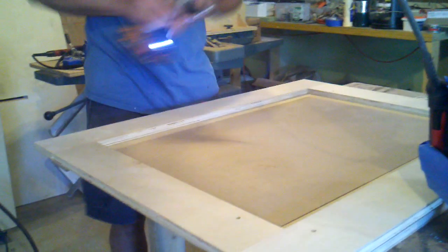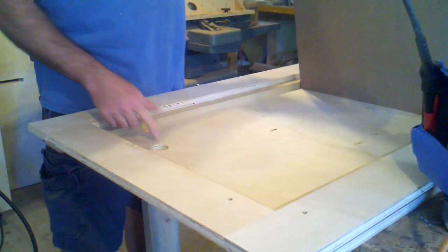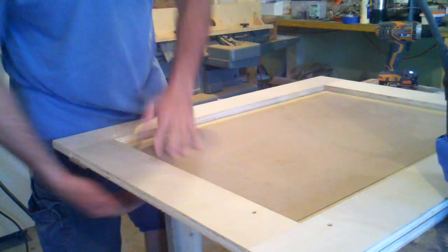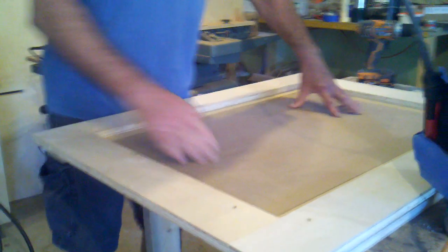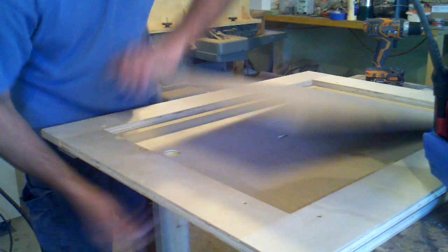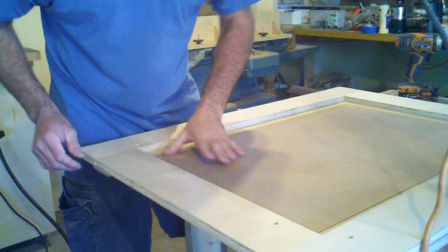Of course it helps to put the screws on the right side. I did put a little hole in the center of the jig, or in the back side of the jig, so you can lift the door out without having to unclamp it from the table. The important part is that this MDF frame that holds the door in place really needs to be flush all the way across. If you don't have it perfectly flush, a couple of simple playing cards in the corners will shim it up so that it's very flush.